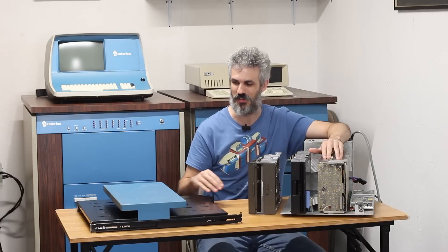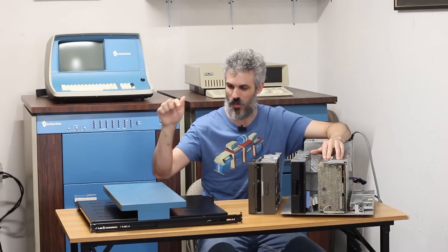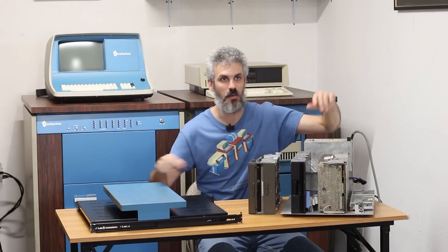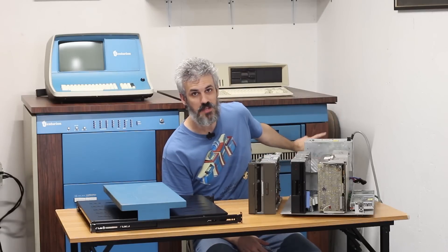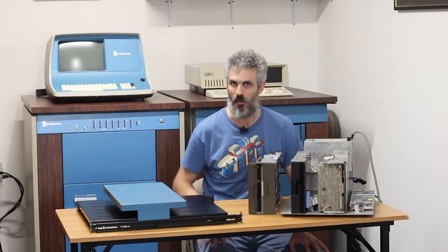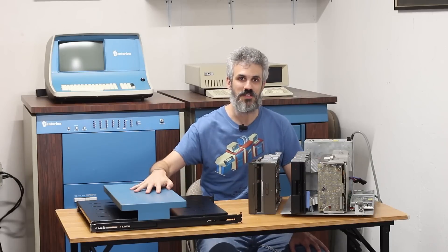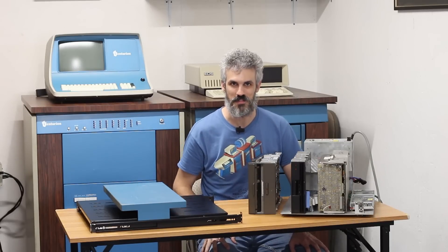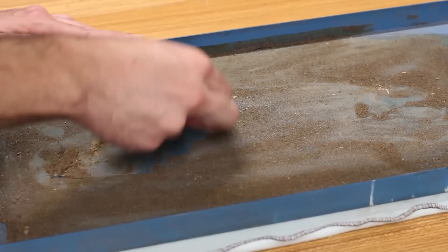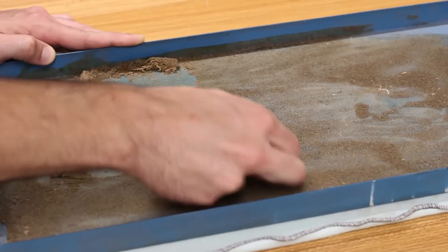We're going to take Mark's drive, get it mounted onto a generic tray I got off Amazon, then drill a hole in a spare front panel and get it all mounted behind the top area of the main cabinet. We're also going to mount the Finch drive right next to it — that's the 8-inch hard drive we got going in the previous episode. Both the Finch and the floppy will be on a tray that you can pull out and access up top where it's supposed to be. We need to bend some metal and cut a big hole in the spare front panel to start.